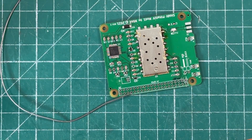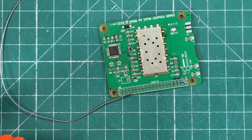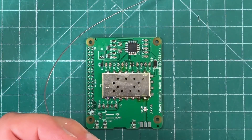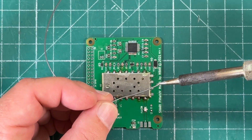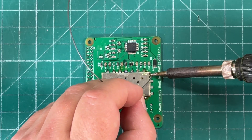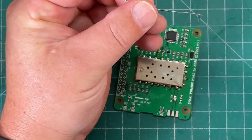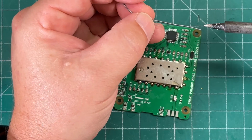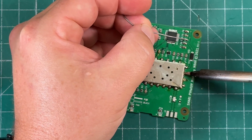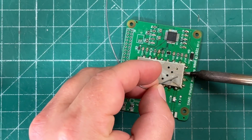I think I just shorted it to the shield... I didn't! Now we can solder pins 8, 9, 10, and 11 — and pins 9, 10, and 11 also need to be shorted to the shield. Pads 8, 9, and 10 require a little more heat because they're connected to a ground somewhere, so I switched to a bigger tip to make life easier.